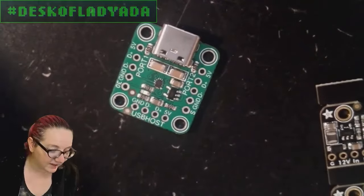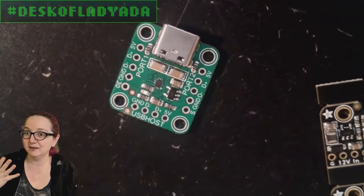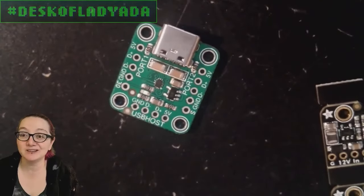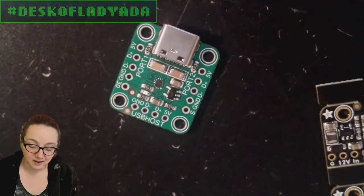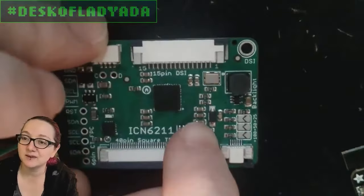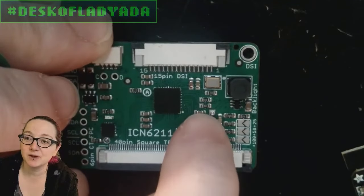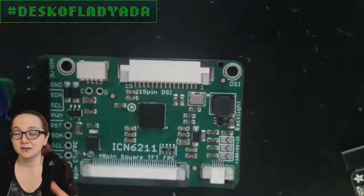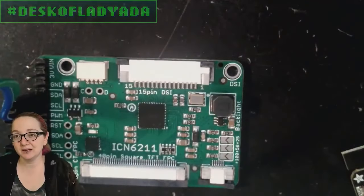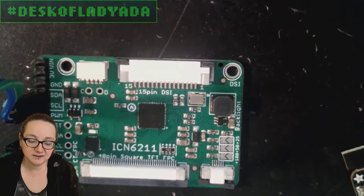So I went back to 10. And I realized I haven't done a great search where I talk about getting just jelly bean 10 microfarad caps. And we use a lot of 10 microfarad caps. Obviously, you pair them nicely, like a Cabernet with some lasagna. You get your 10 microfarad, your 1 microfarad, and then a 0.1 microfarad. You put them together, you've got a full decade of coverage for high frequency and bulk capacitance.